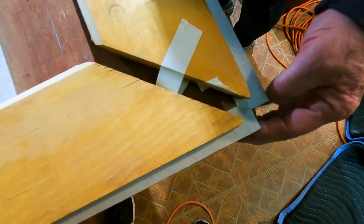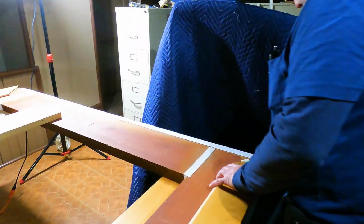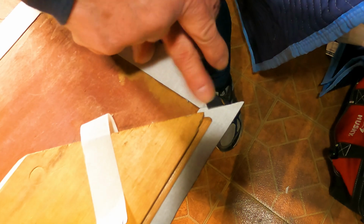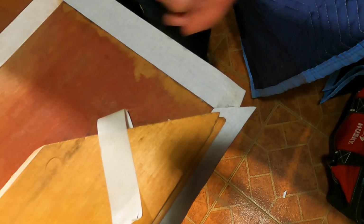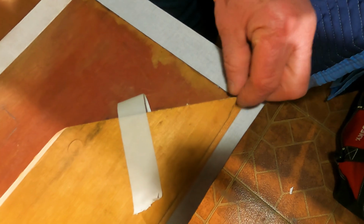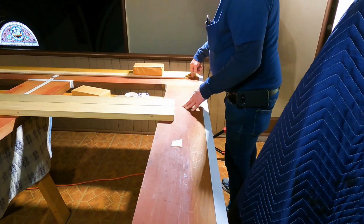And then we'll do from the end of the point all the way around on all of them, just to get it set at a start point for doing our setting. This point is where I started. But I usually start it by setting the point distance on both ends of the given rib from here to there. Okay, that's just a start point, because sometimes these points are different. Some of them are pointed, like even on this one here, you see a piece of the point is gone. So if we were using this side, it would throw everything off. So that's why I do my measurements for spacing off of the angle for the gusset, not the points of the ribs, because they can be very different. Like this one here, the bottom point is short. This one is longer, so you go off of this edge.